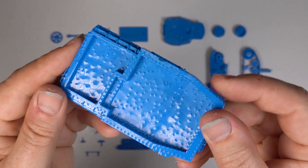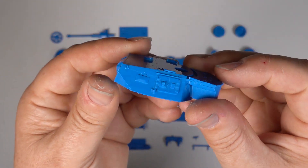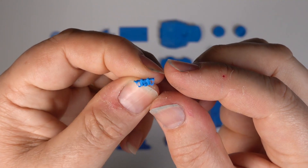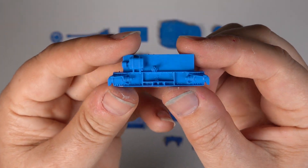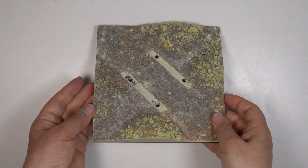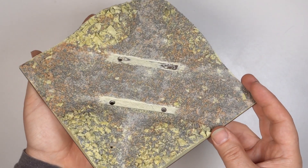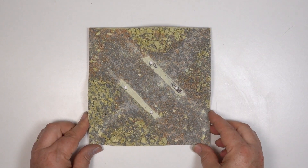The first stage is to clean up all the major parts as thoroughly as possible and then begin fitting them together. The smaller parts will be converted into metal masters using my usual method of cold cure silicone moulds. Before I go too far, I have to sculpt a base for the Panzer IV. This was built up from a sheet of Tufnel in Milliput. A combination of Milliput and granite chips were then pressed into the surface to recreate the ruins of Stalingrad where the Panzer IV is to be set.